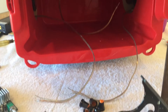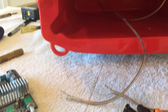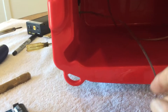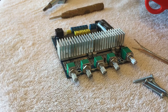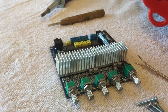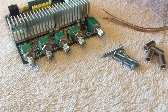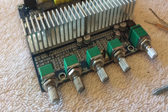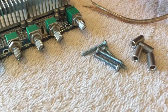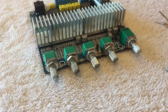We've left the speaker wires disconnected but we've got those mounted now. There's no balance knob on this circuit board, so even though the connections are marked left and right, that really doesn't make much difference. We're going to use these longer wood screws through the mounting holes on the circuit board, with these spacers to hold the circuit board about a half an inch off the surface inside. That'll allow it to stay cool and look a little nicer. Then these knobs are going to be snapped onto the spline shafts once we've got it in place.